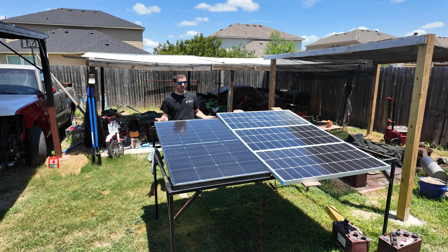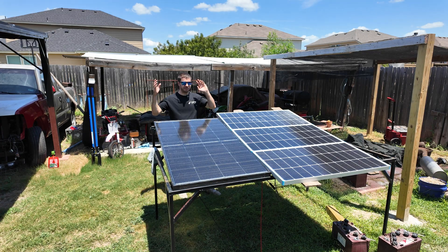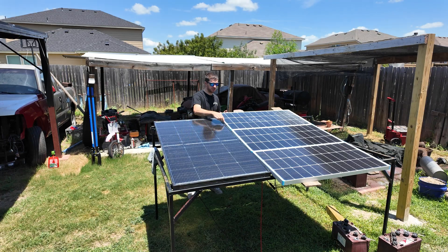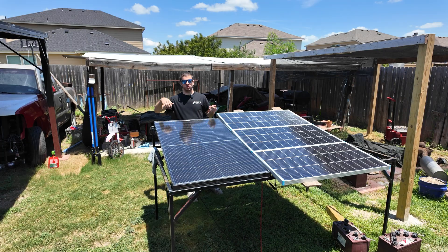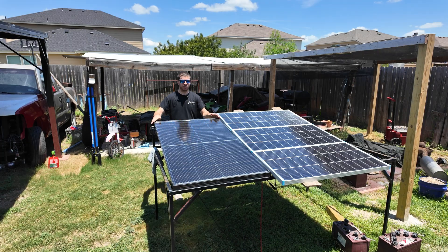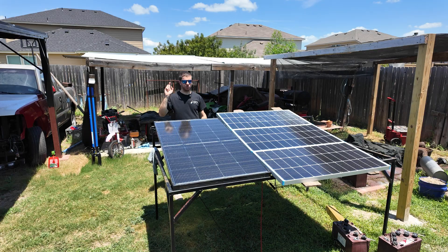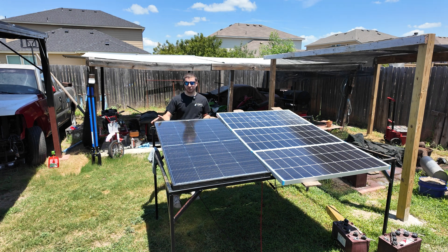On another date, we only made 185 watts maximum power but still generated 1,211 watt-hours — so overall the panel did really well. I think in the future I'll pick up maybe two or three more of these for a full 12-volt system. The biggest thing with this bigger panel versus smaller ones is it's more compact and lighter, so for camping or off-road trips I can take just this one panel, a charge controller, a battery, and an inverter for a complete portable solar power system with only one connection.